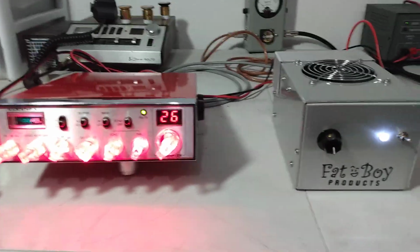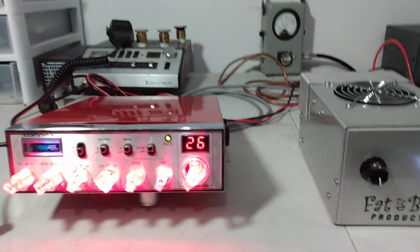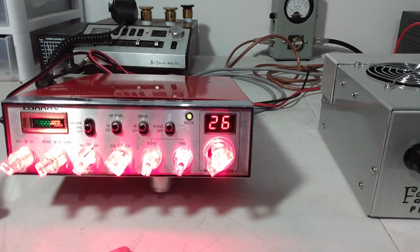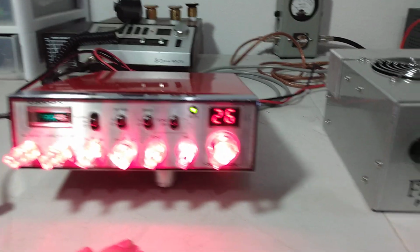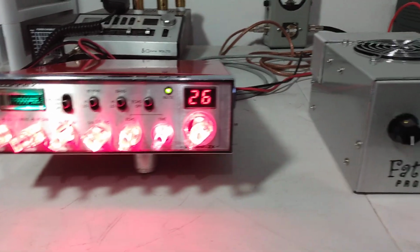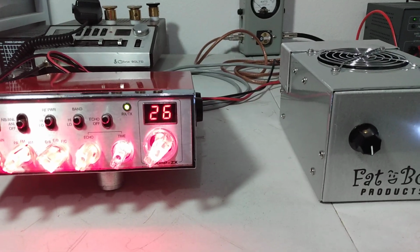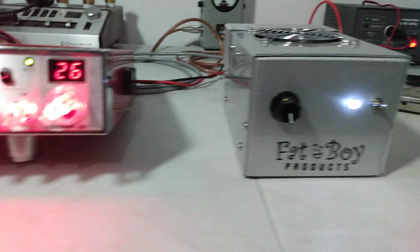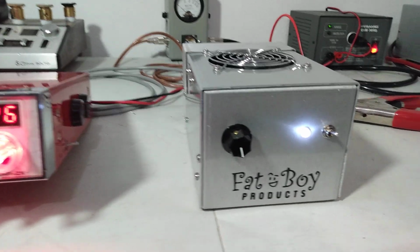All right, guys, back on my old trusty Connex here. If you don't know what it does, around 50 watts PEP. And it does about 20 watts average. So we're going to see if it makes a difference. With the Uniden being a single final, we were at 260 to 270 peak and just less than 100 watts average. So let's see if the Connex makes a difference.